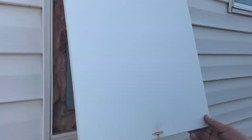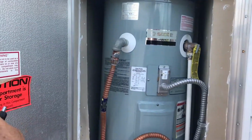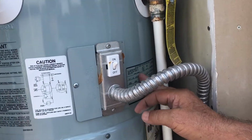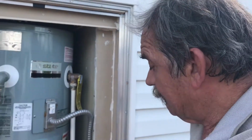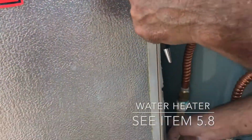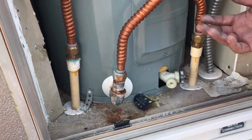Yeah, okay. This is your water heater, 19.5 gallon. Now this is original. So basically keep in mind that budget to replace it. Okay. Is it leaking? No, I don't see any. We have a little bit of moisture damage on the sidewall there, and a little bit of rust here. And the floor is sloped, but I don't see any moisture. I've had it on for a couple hours now. Okay. But basically, personally, replace it now and don't risk it leaking.